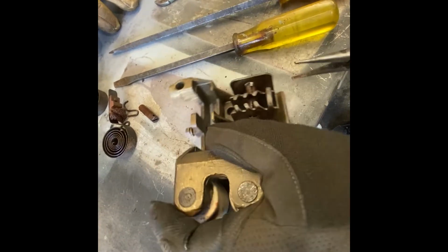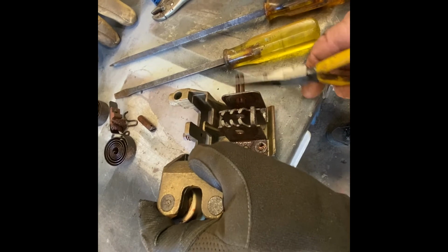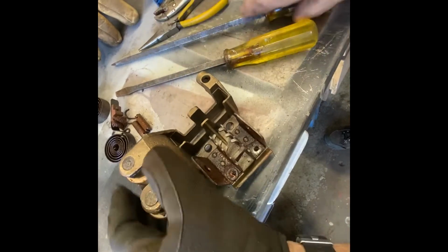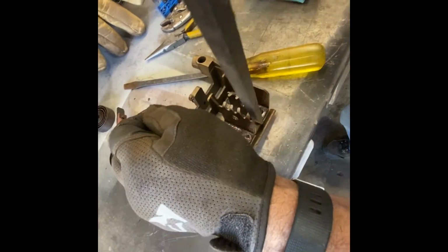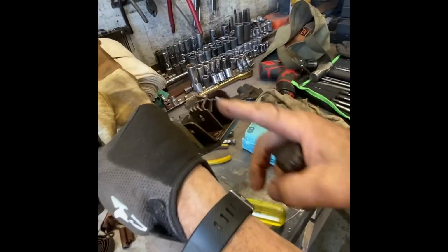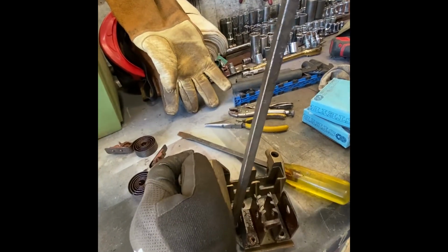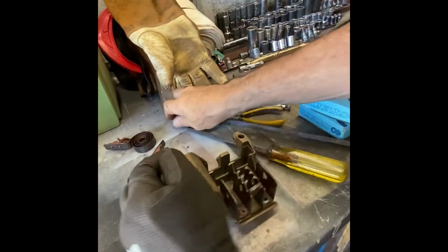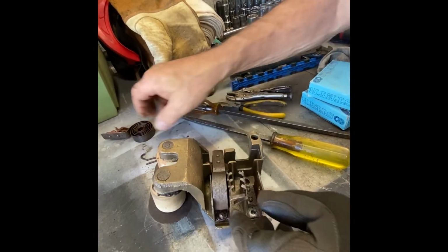So that's got one taken apart. Now, we'll show you a stiffer one. This was a very easy one. To put these things back square, lean against them the other way, gently. Make sure we end up with them parallel. And we drop a brush in, a spring in, to make sure that it has nice movement.